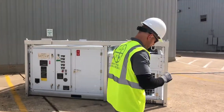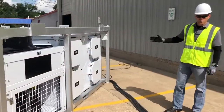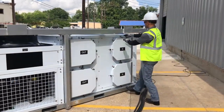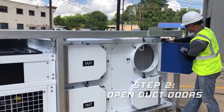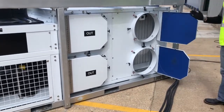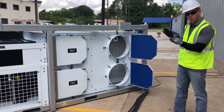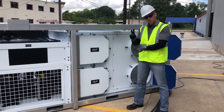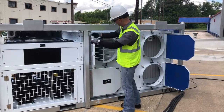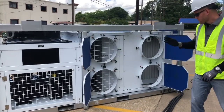Step number two: follow me around the machine. For an air conditioning unit, it's critical that our inlet connections — our returns — and our outlet connections — our supplies — are open. I'm going to go through and open these connections. This particular model has two nominal 20-inch inlets. Under most conditions you're going to want both to be open, because you don't want to starve the machine. This model also has two supplies or outlets; you can run one or two depending upon the job site requirements. I've made sure our supply and return connections are open.